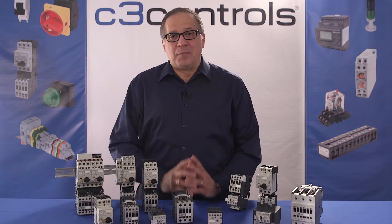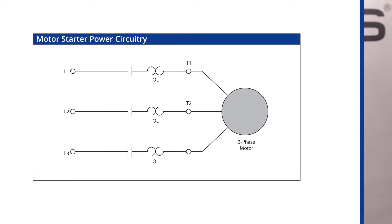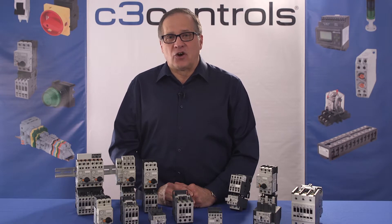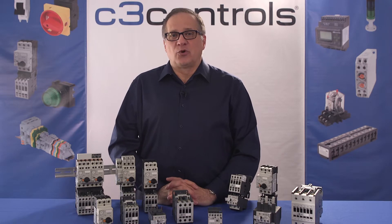There are two circuits in the motor starter: a power circuit and a control circuit. The power circuit connects the line to the motor, providing transmission of electricity through the starter contacts, the overload relay, and then to the motor. The motor current is carried by the power or main contacts of the contactor. A control circuit operates the contactor to turn it on or off. The contactor main contacts are responsible for allowing or interrupting the flow of current to the motor. The contacts in the control circuit are either open or closed. The control circuit energizes the contactor coil, which creates an electromagnetic field that pulls the power contacts to the closed position, completing the circuit between the motor and the line. This way, remote operations are made possible by the control circuit.